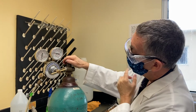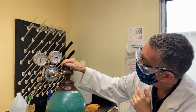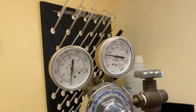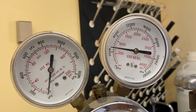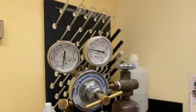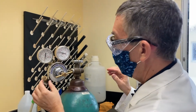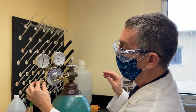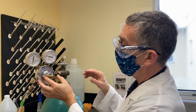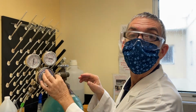Okay. So it looks like we have maybe 5,000 kilopascals. Ask yourself what 1 atmosphere is. It's actually 100 kilopascals. We got plenty of pressure here, right? No problem. Next, make sure this is closed again. You'll want to now righty-tighty turn this in.